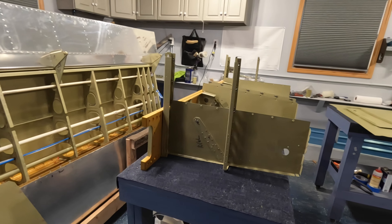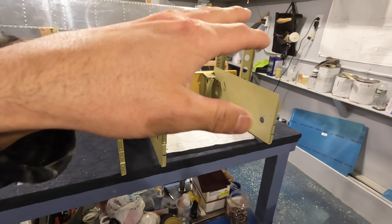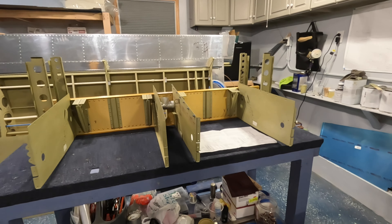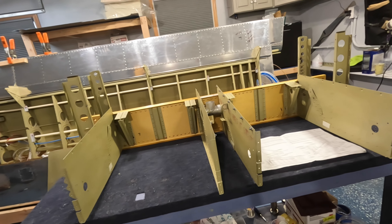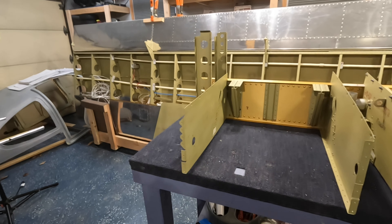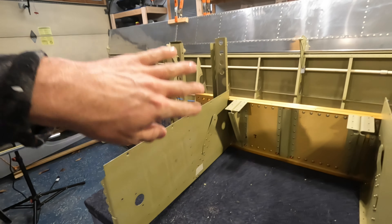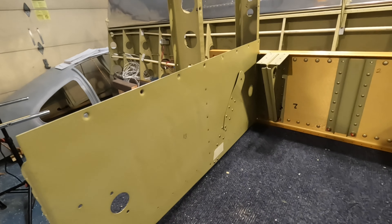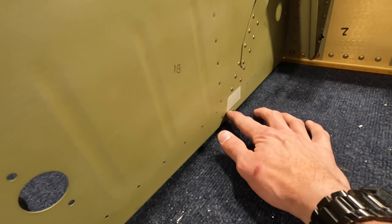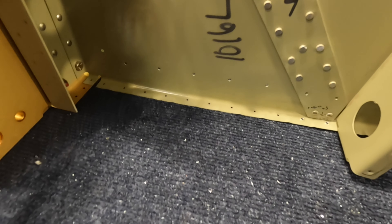I have the right and left seat rib sub-assemblies attached here. This is section 26 — it wasn't really a pain, I just had to re-read the instructions a couple times to make sure I had everything done properly before doing my final riveting. These seat belt attach bars are attached with AN470 rivets and there are a couple different sizes, so please check and make sure you put the right size rivet in the correct hole. These two lower rivets are opposite — the shop head is on the inboard side.